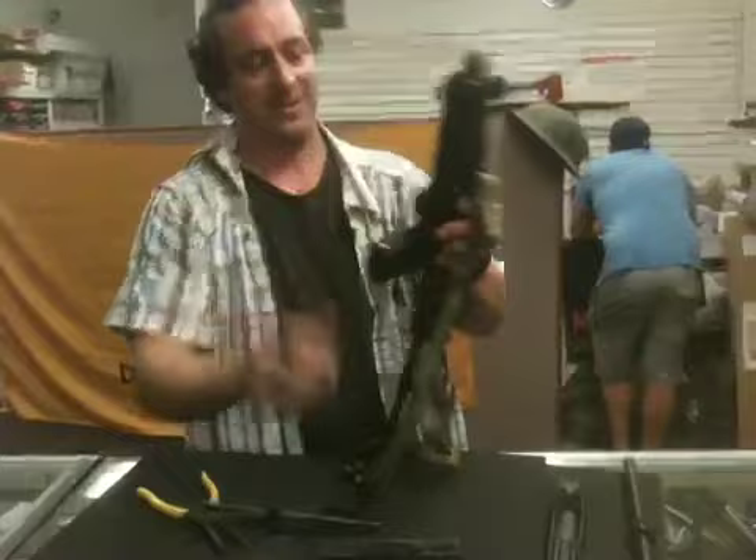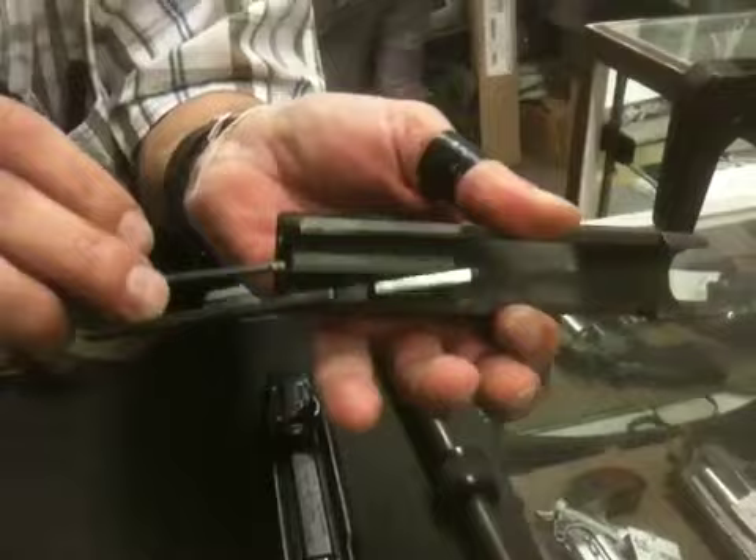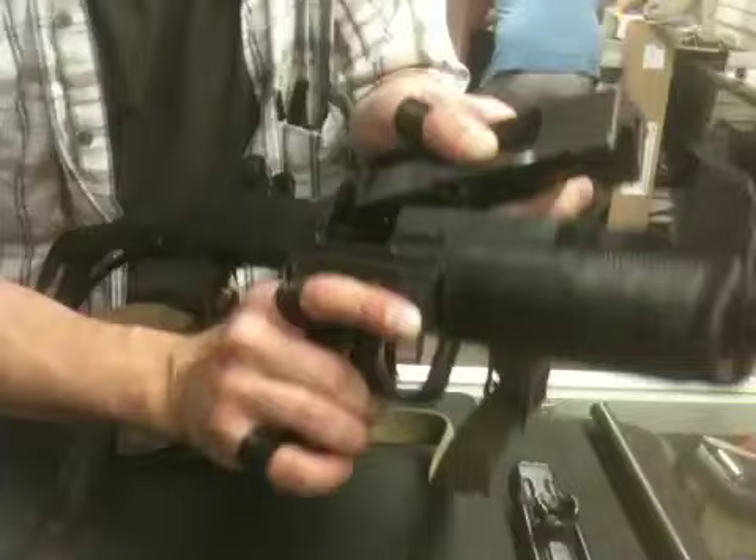You're grouped in. Line it up — these guns are great, guys. Watch this. Pin in. I'm going to do the bolt. The bolt is real simple. Firing pin — see this little tip here. Put your firing pin in the hole. Make sure the little flap is done, see how that is. Spring in. She goes together better than she comes apart.